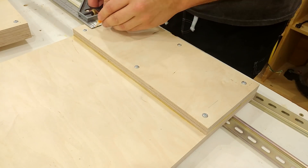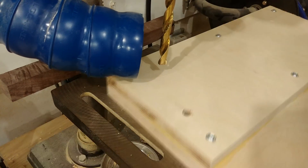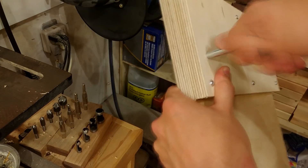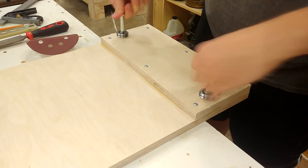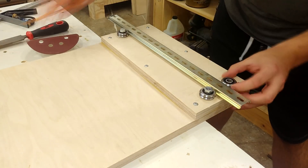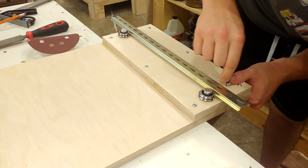I can then mark the location of where the bearings are going to be and bring them over to the drill press and drill them out with a 3/8-inch hole. The 3/8 forstner bit left a little too much slop, and I found that the spiral bit was a great fit. To mark the location of the lower bearings, I first mark left and right, then temporarily install the v-groove bearings and a little piece of rail, and put another bearing to mark exactly where that hole is going to be.